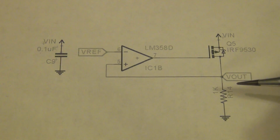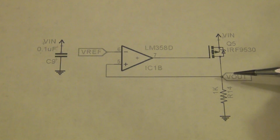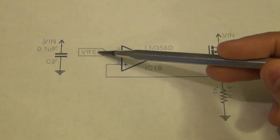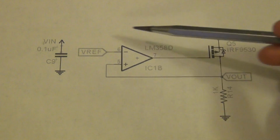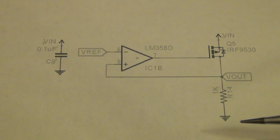So here, what we can do is that because we now have the 2460, which is capable of delivering up to 100 watts of power, we can use that as a dummy load for our voltage regulator, which will basically absorb the current from the regulator at any desired amount while we power the V in from an external power supply. And we can also use our other SMU, the 2450, as our reference voltage for the op-amp. So by using the 2450 and 2460 in this configuration as a V reference and a load, we can do a complete characterization of a voltage regulator.